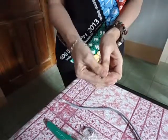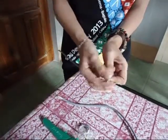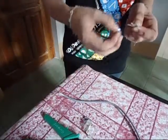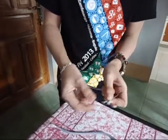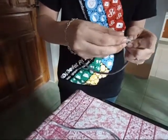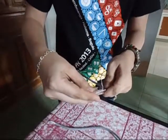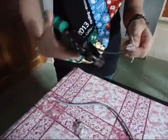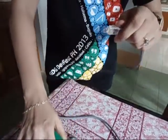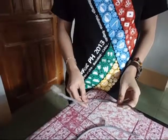Press all the wires flat and parallel between your thumb and forefinger. Keep wires flat in order as you push them into the RJ45, with the surface of the wire plug on top. Place the wire plug into the crimping tool. For the other side, repeat this step. We are done with the straight-through cable.